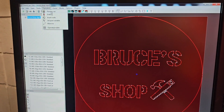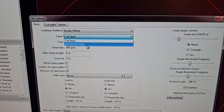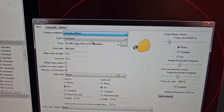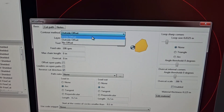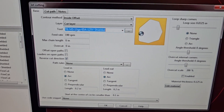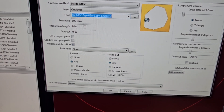I'm going to go up here to Operation > Plasma Cut, and here I have the option of which layer I'm cutting. I'm only doing my cut layer — not the circle or outside shape. I'm doing an inside offset, not an outside. You can see how that's the cutter going around a line versus inside — we'll cut inside the shapes that I've created. I'm using tool number T6, 10 gauge.